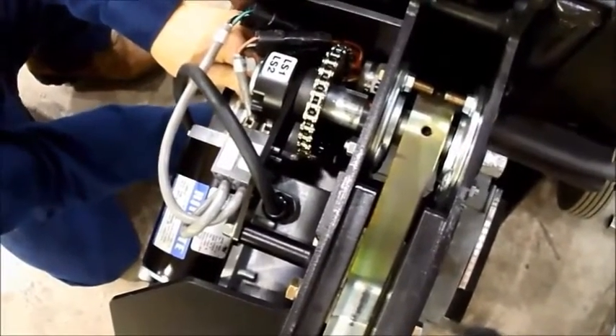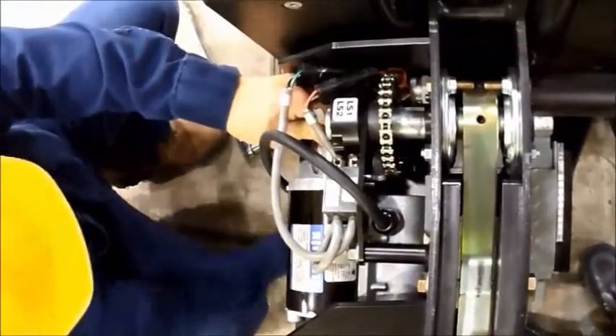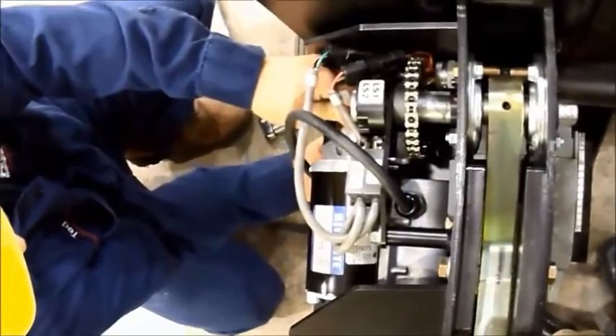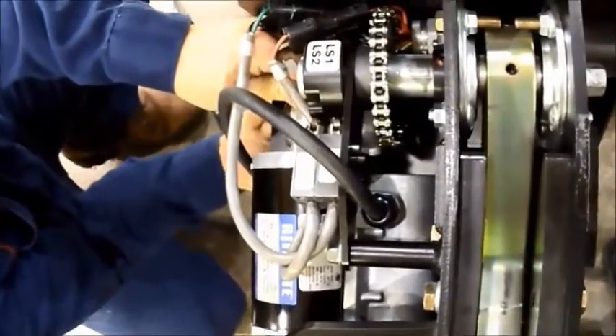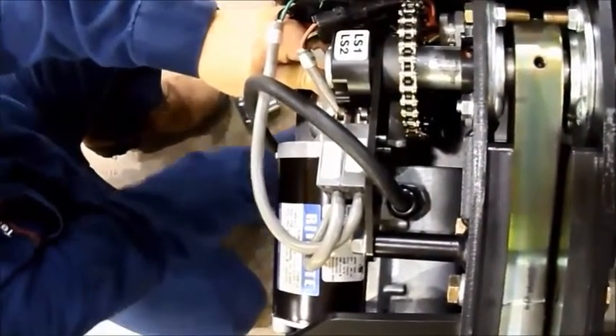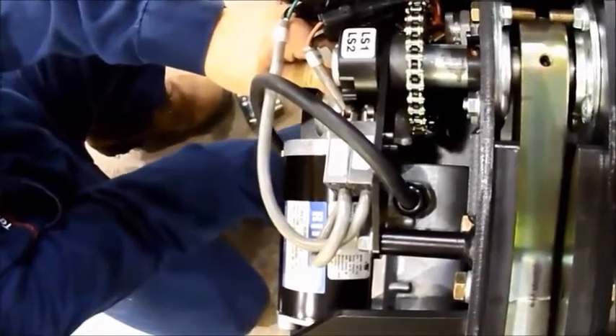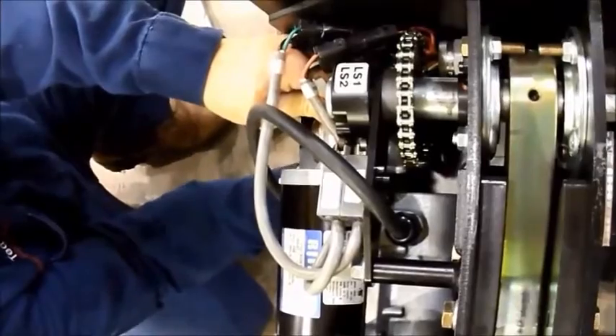Holding down the front side of the dock lock gear motor, start the front bolts. Start all four bolts, actually, underneath the unit. Don't tighten them too tight at this point — just get them snug enough where they'll hold the motor from tipping.